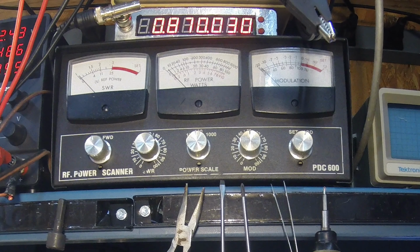I think the only other thing I've got to do is actually set the sideband power. Let me go ahead and do that, and then I'll set the meters off camera. No need for you to see that, but go ahead and switch her over to sideband. Sorry, I had a tone turned on here. Let's just set the sideband power, which, dang, she's at 20 watts now. You don't want her at 20 watts. That's too much. That's too hard on her. Let's do about 18 watts. Yeah, right about 18 watts on sideband.